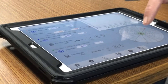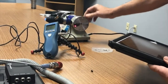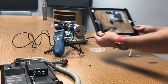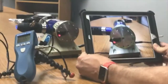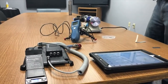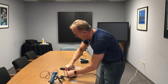I type 0.025 into the appropriate box and hit done. It wants me to put the trial weight at 238 degrees, shown right here in the polar plot. I hit the angle view and immediately get a polar plot with a dot on the camera. I put my reflective tape at 12 o'clock — that becomes 0 degrees. Holding the tape up, you can see right at the red light that hole is where it wants me to put the trial weight. We've weighed it, entered the weight, and now place it right where the red light indicates.